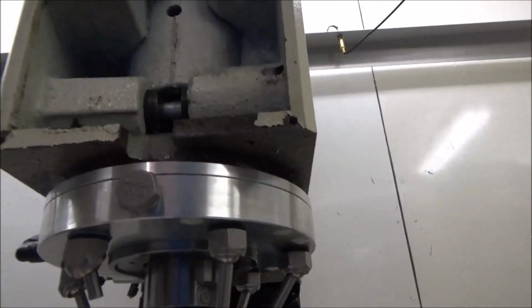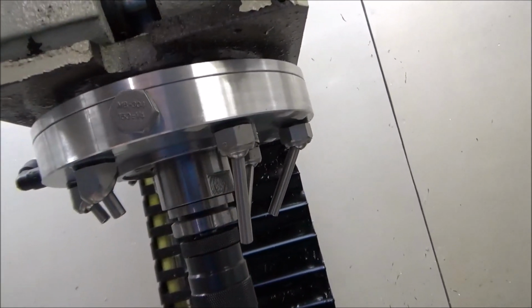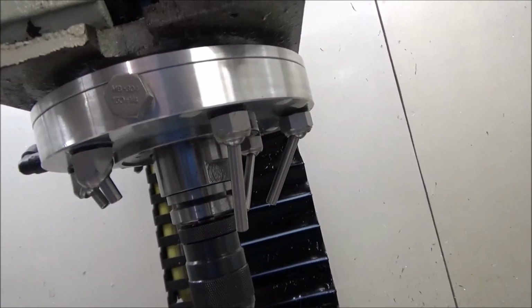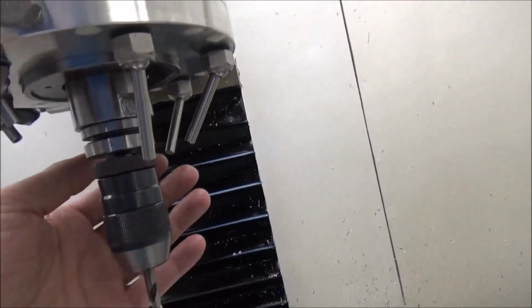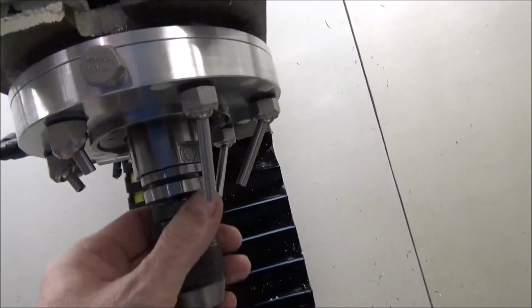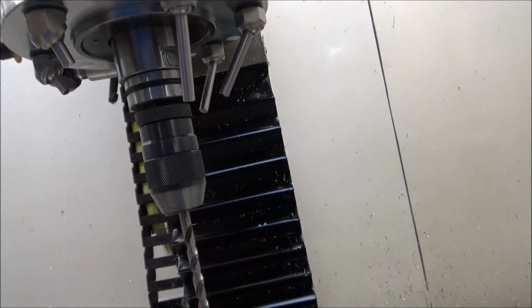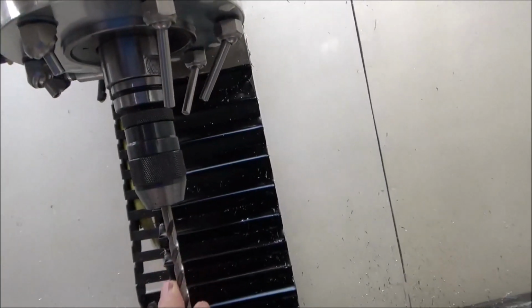These two right out here in the front, this one and this one, I've got set for two different drills. So they kind of look like they're spraying out here in the middle of nowhere down here on the vise. But when you've got this long tool in here, these three on the back will be spraying all around up here on this drill chuck, because the tool is so much further down. And these two here will be spraying on the drill. So it's still getting lubricated.